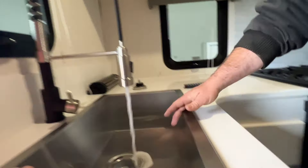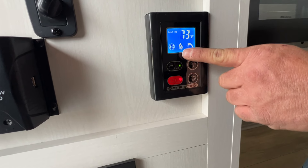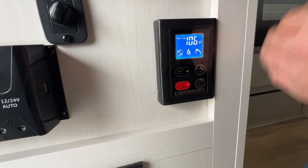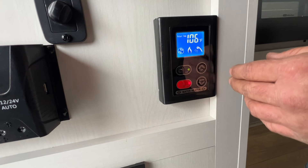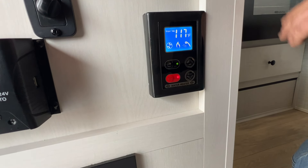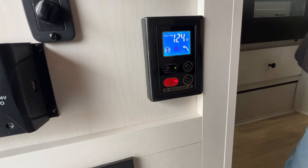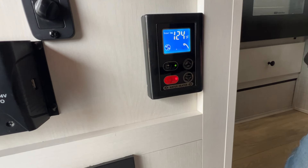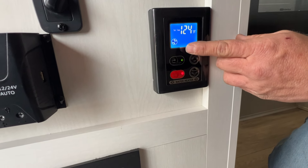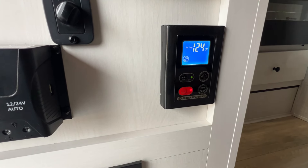We'll show you how this starts to work. I'm going to turn on our hot water right here. This is automatically going to fire up — it's saying hey, I'm calling for water. It's turning on the fan to get going, and now it's igniting the flame. This is the temperature that it is sensing as it's coming through your water heater. As you see, it's slowly getting that climb and starting to do that work. It does take a minute to actually get going. We should get to about 124 because that's where we're at max. When you go to shut it off, it's going to sense that we aren't calling for that demand anymore, so it shuts off the flame and the water supply. But it's got that fan continuing to run to cool it back down.